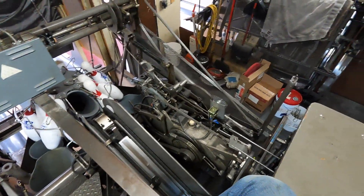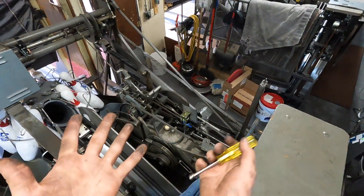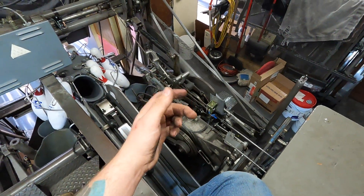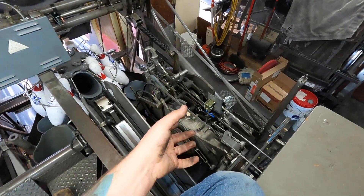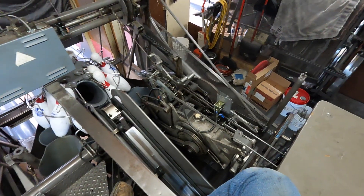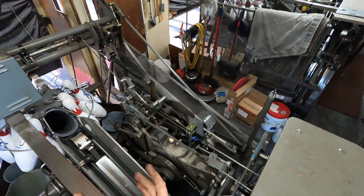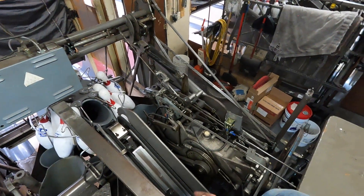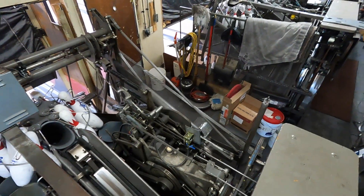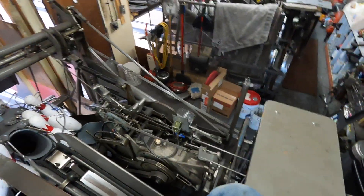So I know the book has like three, four, five, six steps to this adjustment, but I have found this so much easier — just at zero degrees, pull up on the solenoid all the way up, squeeze the solenoid to make sure they stay together, and then tighten up the screws in the back. It's three things you got to do. Please leave in the comments below if this actually works, because I'm wanting to know if this works across centers or if this is just me getting lucky all the time, which I find really hard to believe.